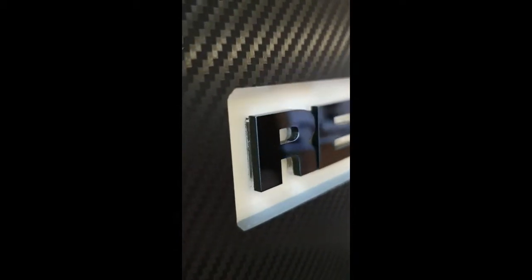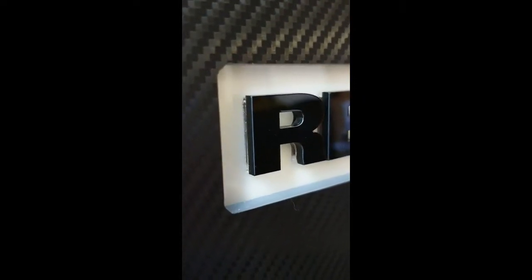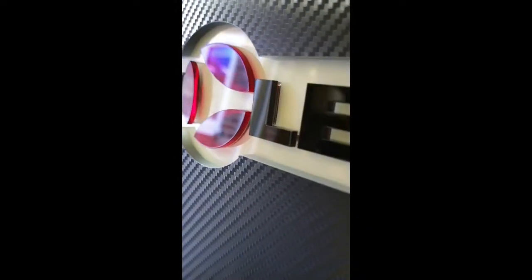On top of that, using the laser, I created jigsaw pieces, if you like. You can just about see, and the photographs later will show, there's a 2mm spacer cut from clear acrylic, and that is hollowed out as well. So that's got a 2mm thickness and height. I bonded that onto the white acrylic first with the acrylic cement. So that was there first. And then I used the laser again to cut the Revolectrix lettering, and used red for the leaves in the middle. Again, they're all supported on the 2mm thick clear.